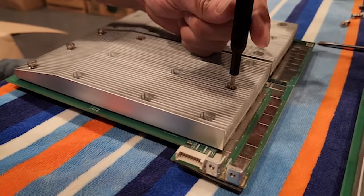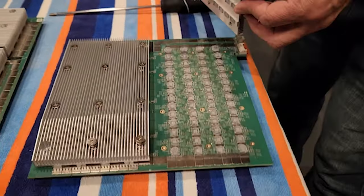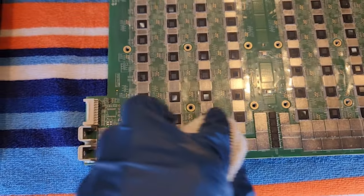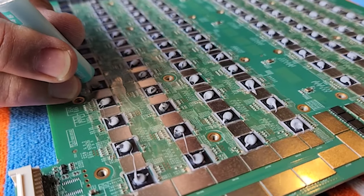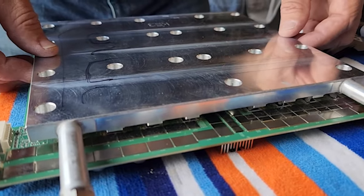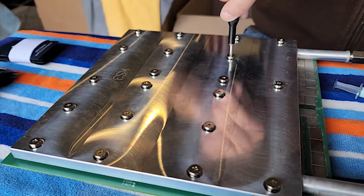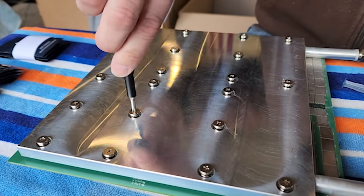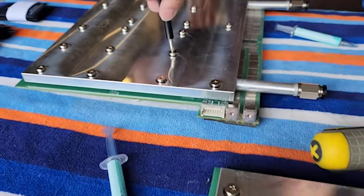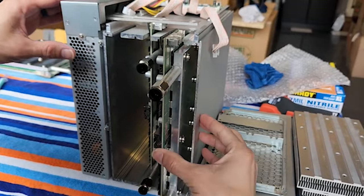So the process to do the conversion is fairly simple. We removed the heat sinks, cleaned up the chipsets, and of course repasted and installed the heat sinks carefully while paying particular attention to align all the mounting holes. Making sure we torque down in a proper random pattern to distribute the load evenly. Then reinstall the hashboards.